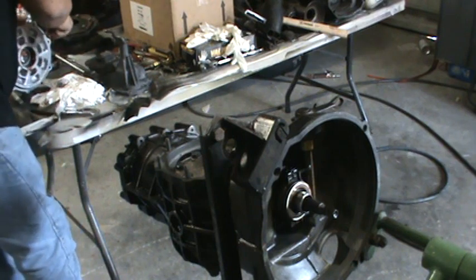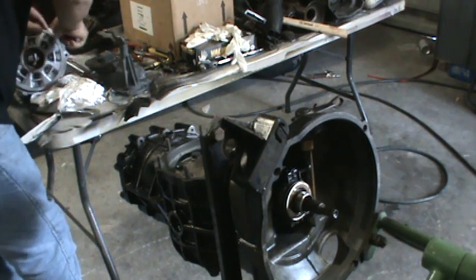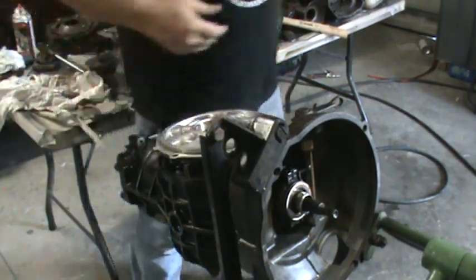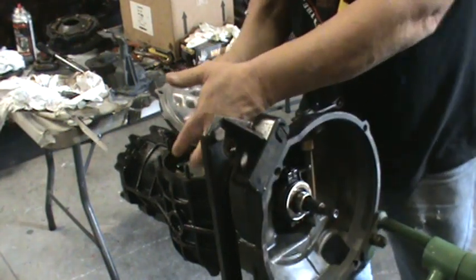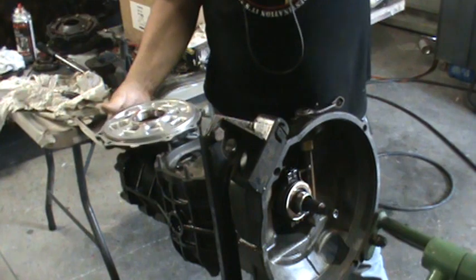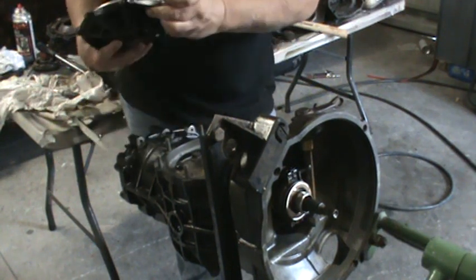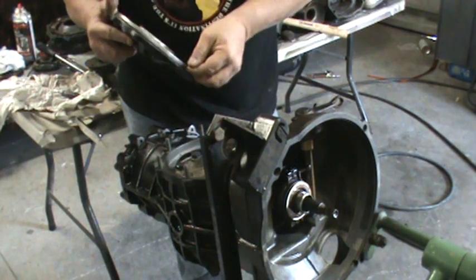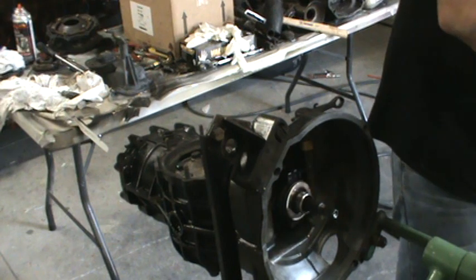Get this O-ring off of here, put a new O-ring on. I'll take that off, give it a little quick wipe. The side plate looks a little cleaner — just gonna put a new O-ring on it. Make sure that bad boy sits down in there proper. We're gonna put a little aviation Permatex around there to help lubricate that O-ring and seal the tranny up.